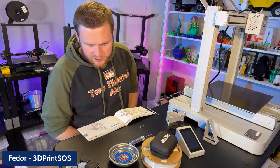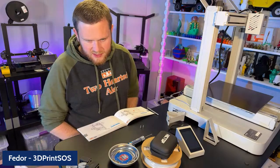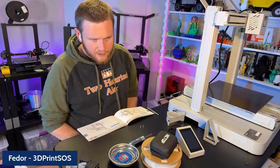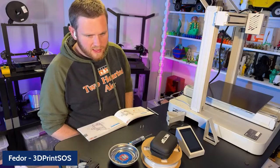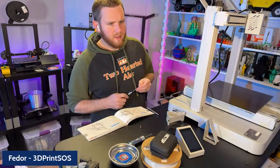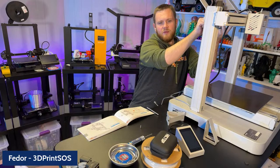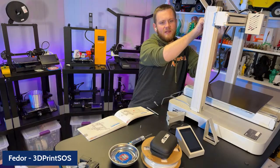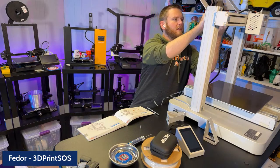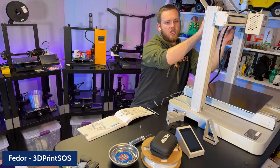Why do you think the Chinese printers are limited to a bed of 100 C and a nozzle temp of 260, but still use PTFE tubing? The parts are made over there, and only the flagship models are Creality. I think about this often, actually. Like why the software goes way higher than PTFE tubes, and they still put PTFE tube hot ends. And it's got to be that they're recycling manufacturing, reusing machines and parts, and getting them as cheap as humanly possible.